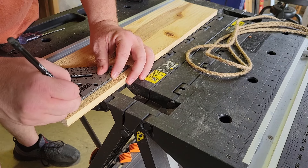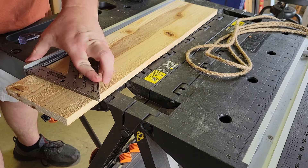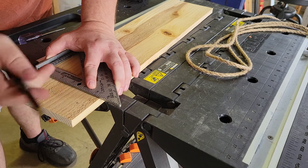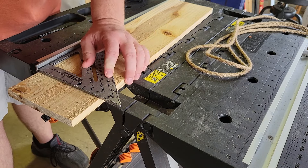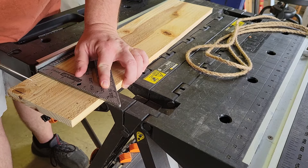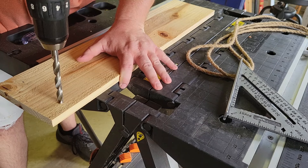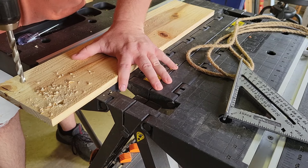Let's measure down about an inch and a half, and come down here an inch and a half. I want to come in about an inch and mark out where we want our holes, and trace those other lines so we don't get too confused. When I was practicing, the drill bit was walking on this cedar pretty bad, so I got myself an awl and I'm just going to go right on my center point and make a hole to get us started. It was a little better, but still did some walking. Probably a brad point drill bit would be best.